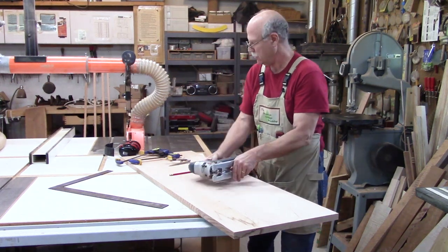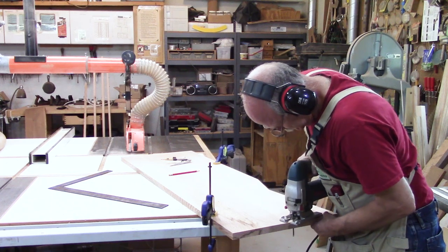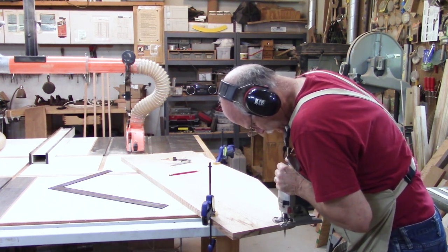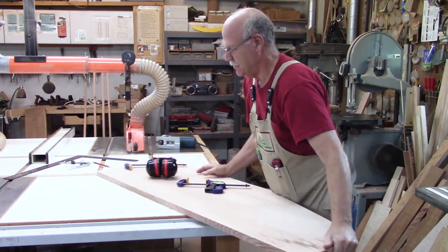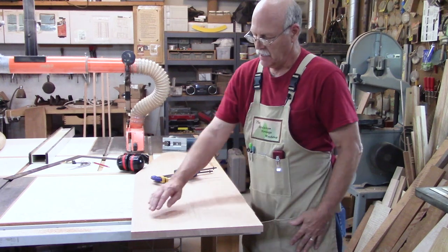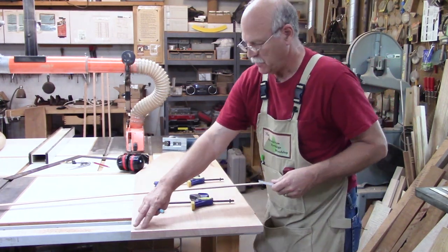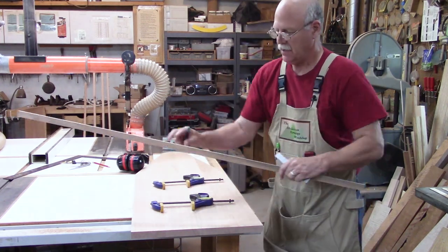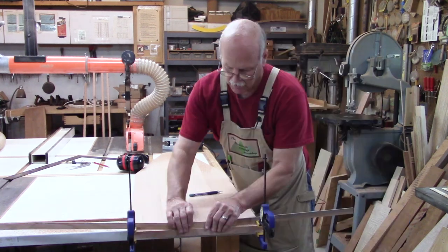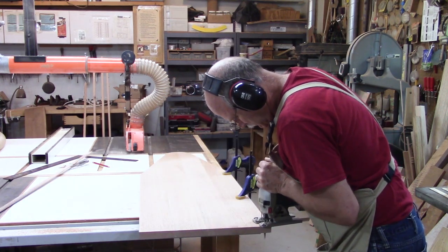For this application, I'm just going to use the jigsaw. When using the jigsaw, always be aware of what's under the board you're cutting so you don't cut something you don't want to cut. The end of the ironing board — instead of having it square, it looks too abrupt. I like to do a very, very slight contour on it. The way I like to mark a small contour is with a flexible piece of wood. I'm going to measure back one inch on each end, put the clamp right on that one-inch mark, bow the wood until I get it where I want it, hold it, and mark it. And that's the shape I want.